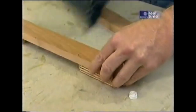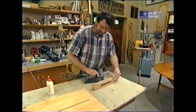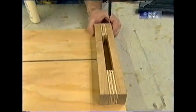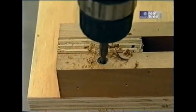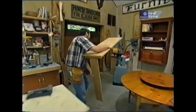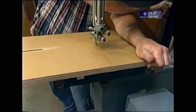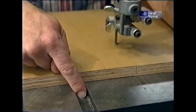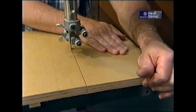I'm going to take a couple of little blocks of plywood and some pieces of hardwood and create a little pocket into which I'll be able to put a leg. I'll position it right on the end of the jig and attach it with a few screws. A piece of six-inch, three-quarter inch plywood fits in that pocket and then I have a leg — I may not need the leg for every single tabletop, but for large heavy ones it's going to come in handy. I've made a cut in the jig by placing the hardwood strip in the miter gauge slot and making a pass through the saw. That gives me a piece of material out here which will support the waste material as I cut tabletops.